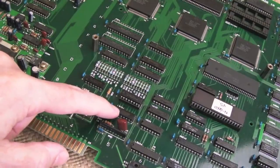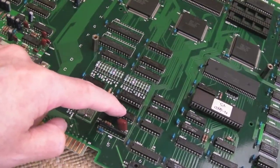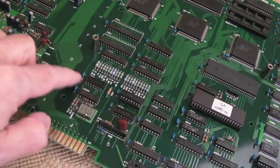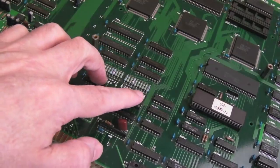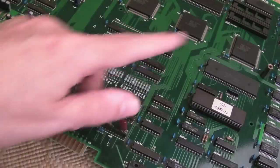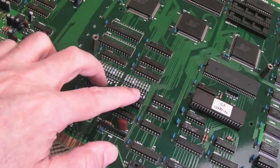One thing I did spot, and I've not shown you, I put a little fixed wire, I'll show you in a sec, underneath this 161, because at the point where I was trying to address the clocks, trying to work my way through the clock circuitry to understand whether all the clocks were part of the problem. I mean, they weren't ultimately. It was just after that I went away and thought maybe all the SRAMs failed at the same time. It's funny how my mind works.